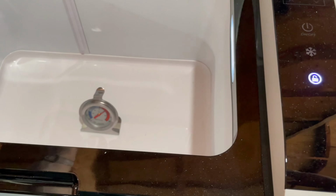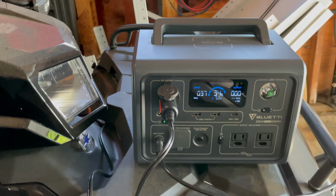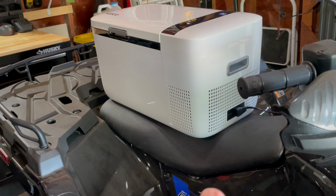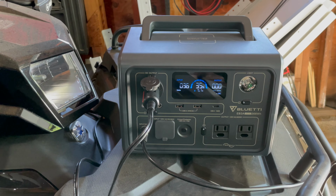But how are we doing here? Right now, the IceCo GO20 has cycled off, so it's pulling 0. The Jackery Solar Saga 60 foldable panel is pulling in 37. So here's an opportunity where the solar power is going to now offset even more whatever the GO20 needed, because it has cycled itself off at the moment because it reached the temperature, at least it thinks it does. We saw 50 on the inside thermometer, but we'll come back again. But this is where we can add a little to the EB3A before the IceCo GO20 cycles back on again.